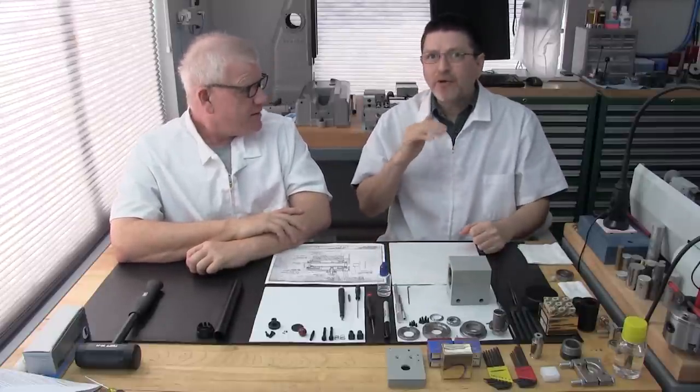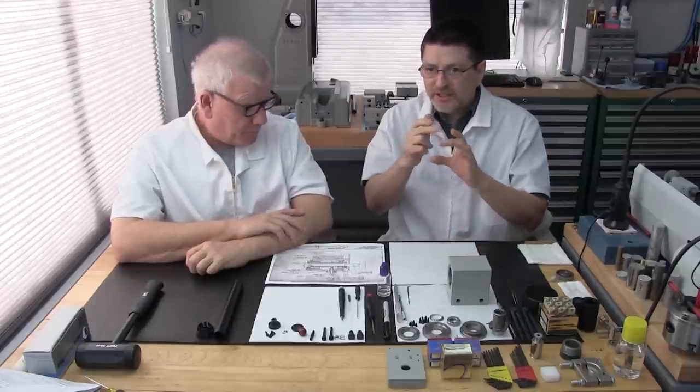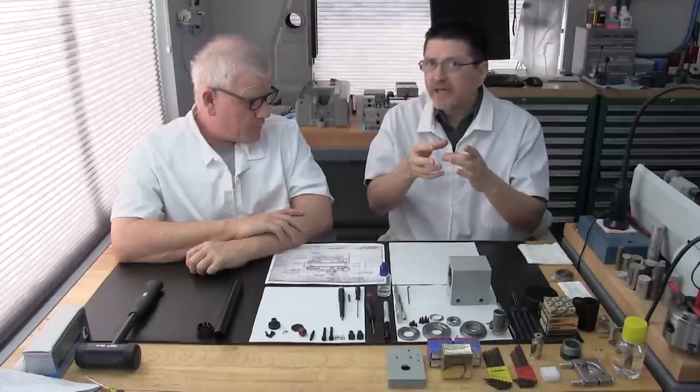Oh boy, I see the word machining and I do get a little excited. That means we're probably heading out to the machine shop shortly. Yes, finally. Okay, at this stage, if you haven't already done so, this is the time where you're going to want to modify your angular contact bearing. That's machining the groove and then adding on the retainer ring.